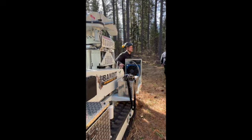When you're done with that, guys, make sure on your engine mounting bolts, your 4 bolts, your 2 back there, 2 up here, torque those down to 180 foot-pounds. If those aren't torqued enough, when you hog a big log through, it's going to pull that engine back, get everything out of adjustment again, and do damage to your drum. Any questions on how to adjust that belt?